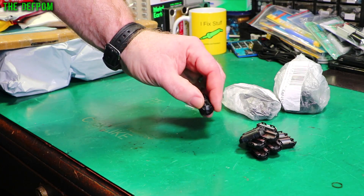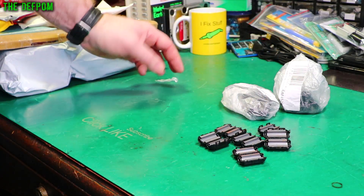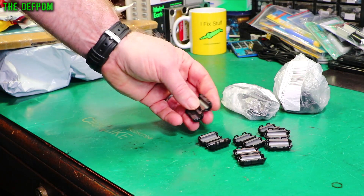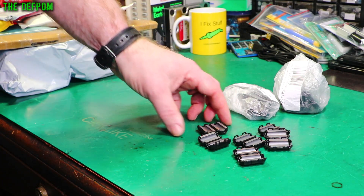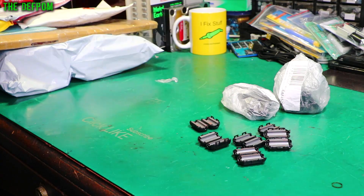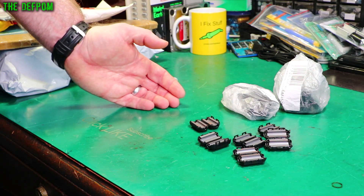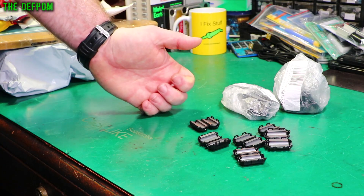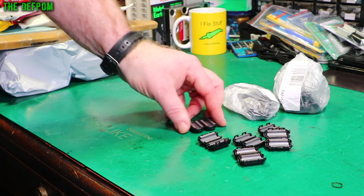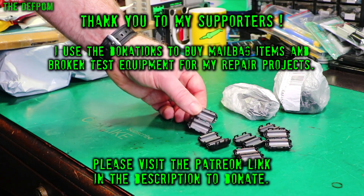We'll see what happens. I probably won't be able to tell the difference, but I just think it's a smart thing to do — that's why these things exist in the first place. EMI filtering is an important aspect of reducing noise going back into the AC line. I tend to put these kinds of devices on everything. All my power cables across my bench have got ferrites on. I'm just trying to keep noise down as much as I can, because trying to do precise measurements in a noisy environment is pretty hard. Every little thing I can do to help — even if it's an insignificant amount of improvement — I'm still trying to keep it down. Who knows, maybe if I put enough of these on everything it'll get rid of any EMI which may be getting transferred between equipment through the mains, and having these on all the power leads means there's a chance it's improving things.